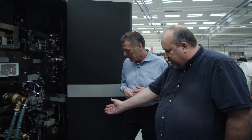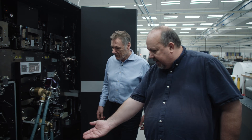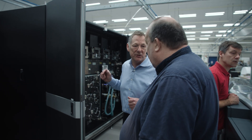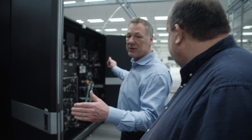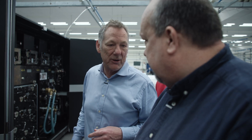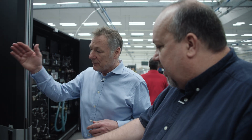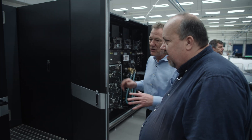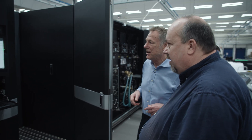After the paper is chilled, it goes under the drying section and then through a turn bar. One other thing to mention is how compact this printer is — it is only nine meters from end to end without any finishing devices, which is probably less than half of some of the other machines in this area. The turning bar is a simple analog turning device, like we know from every other two-engine printer in the world.